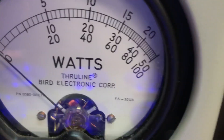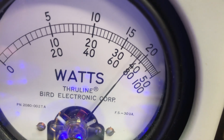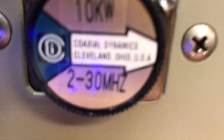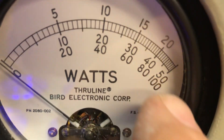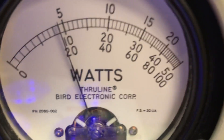We're going to start with the 2500-watt slug. It's my 8-pill so I got it set up at 2000 watts. That's that Bird meter - 2500-watt Bird slug. Now that's reading on a Bird: 10,000 watts with the numbers wiped off and my label printer printed numbers on it. We're reading the bottom scale: 2000, 4000, and so forth.